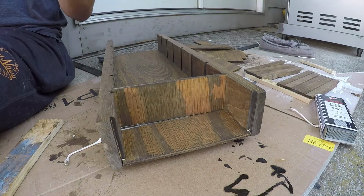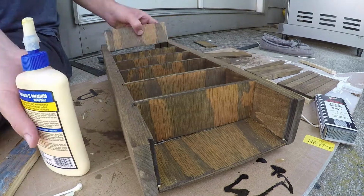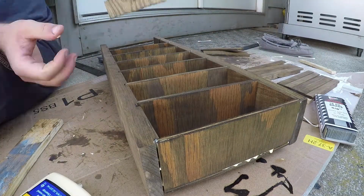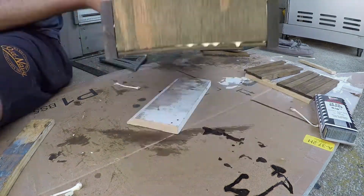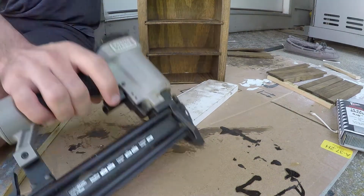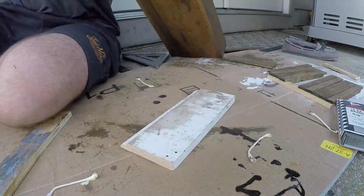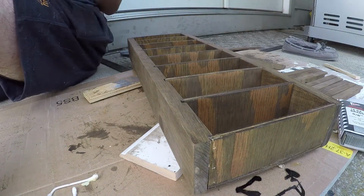If all 3 sides aren't sitting perfectly flush against the surrounds here, don't worry about it too much. When we tack on the very top and the very bottom shelf, that's when you're going to have to make sure the shelves are squared off to the sideboards. It's a little out of frame here, but I really clamped the sideboards together as much as I could. That way the shelves were nice and supported and tight on each side when I tacked in the very top and the very bottom shelves.